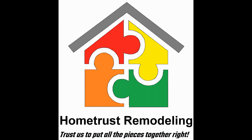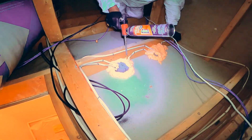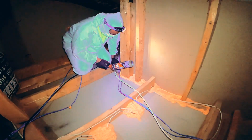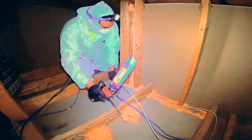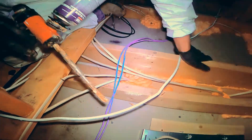In this next clip, it's a house similar to yours where the insulation was draped, giving us a clear canvas. You can see how we air seal a knee wall, how we air seal electrical, around bath fans, and any type of hole running through the top plate — which is the top wall.